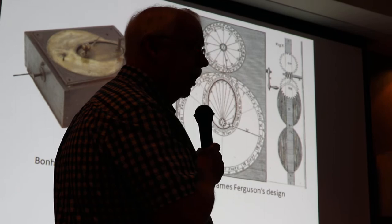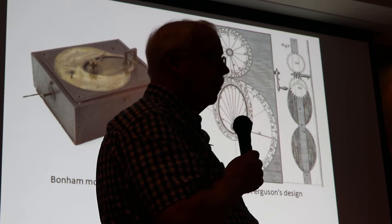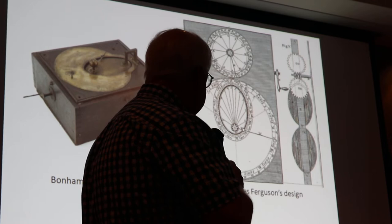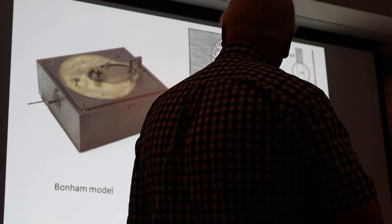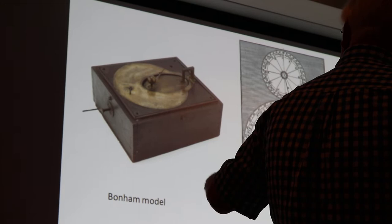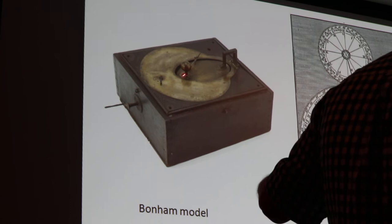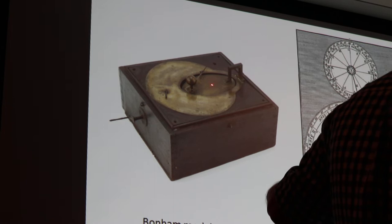There are numerous solutions involving elliptical pulleys or gears, all with varying degrees of difficulty. I came up with a design that's a little simpler, but I cheated — I used CNC. You can see the inner plate is being held by a bridge. It's all very awkward and bent over the years — you can even see it's been re-soldered. The input crank is on the left, the calendar is between the crank and the sun, and the orbit of the comet is defined by the separation between the inner plate and the outer plate. I don't think this one even goes around all the way — the sweeping arm can't go past the bridge.